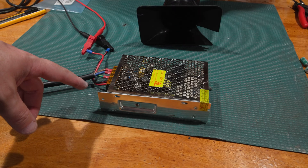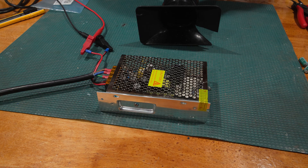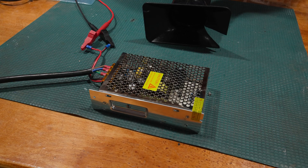I tweaked the control a little bit to see if I could boost the loaded voltage — I could, but when I took the load off it went all the way up to about 13 volts, which is running a little hot for the devices plugged into this. So I balanced it: unloaded it's sitting at 12.5 volts, loaded it's 11.71 volts — call it an 800-millivolt drop when you ask the supply to deliver 10 amps. Through the magic of the camera, the burn-in testing has survived and everything's been good, so it's ready to get back in its enclosure for re-delivery to the customer tomorrow.